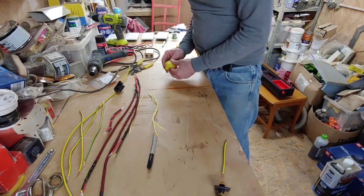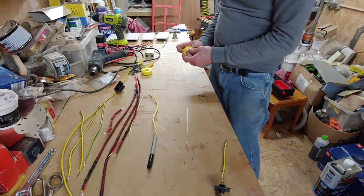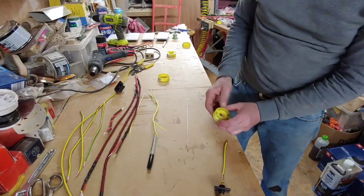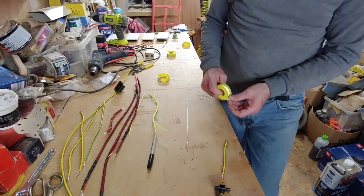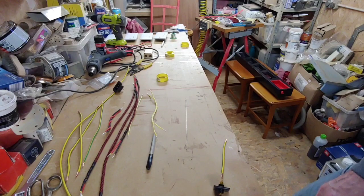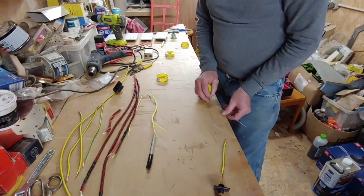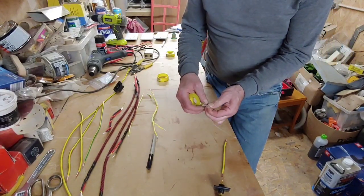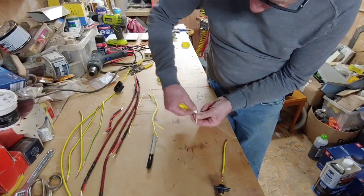And now we're going to be giving these conductors 3 layers of PTFE tape. Okay, so this is a high density PTFE tape, which is a lot thicker than your average PTFE tape. Just check that's filming still okay. Yeah. Right, so very easy to spin this short amount. You get it into your fingers like so and just keep going around like that.